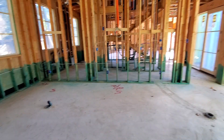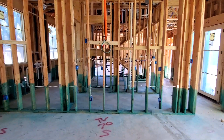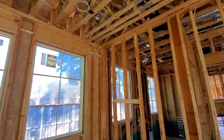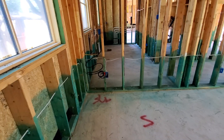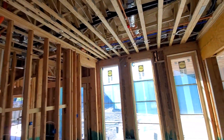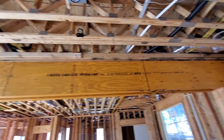Here at the living room we have our TV location — this is going to be a pretty cool floating wall, I can't wait to see it when it's done. We have a motion detector wired up in the corner. We have a subwoofer wired at the bottom left just in case they want something a little better, but we have our full 5.1 in-ceiling wired around, and right here in the middle we'll have an Origin Acoustics 10-inch in-ceiling sub that sounds really, really good.